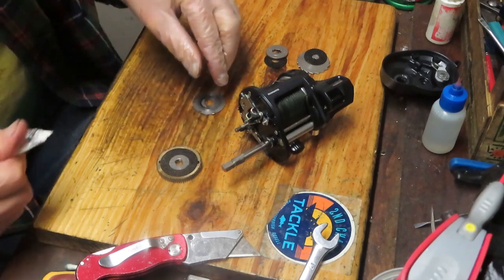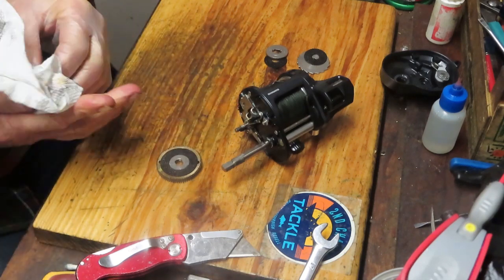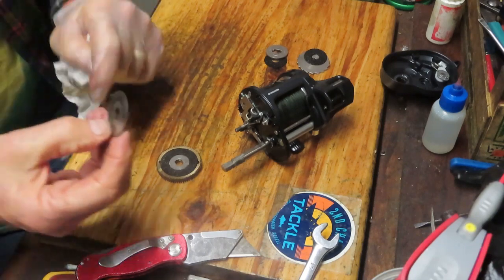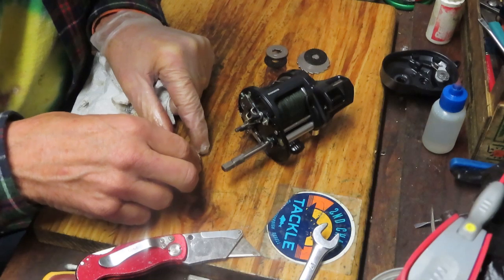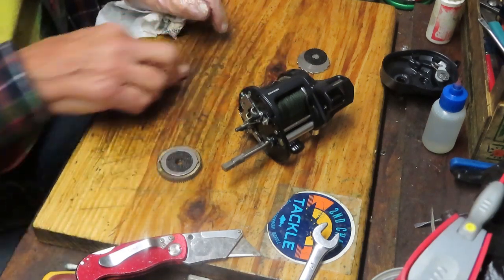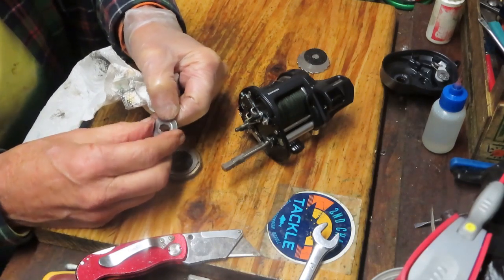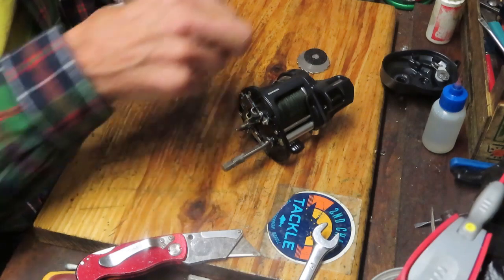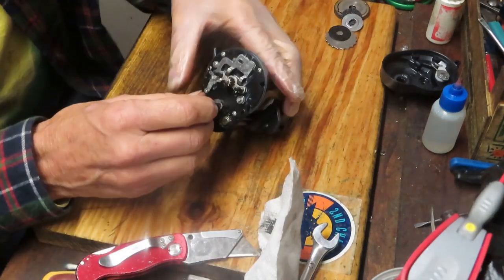Second of the drag washers then, the top one here has the two points on the outside. This is called an eared washer, and they're bent down. They face down when you go to reinstall the stack. Then we have the smaller one, and we have the one that's got the slots for that gear sleeve spacer above. I'm just going to take those off to the side for a moment. We still have to grease that, but that's the setup for this one.